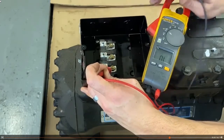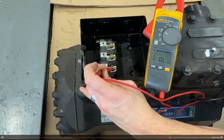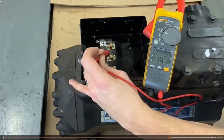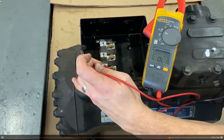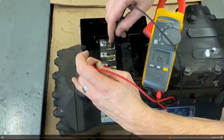Let's see if I find a good grounding spot — I'm going to ground. It's not touching ground. As you can see, I got no resistance to ground, so it's not short to ground. But the windings are open.